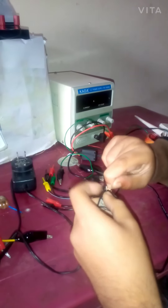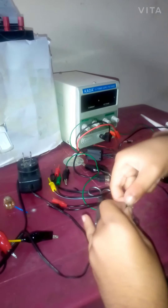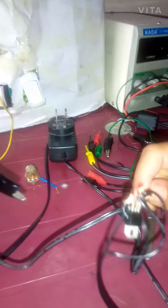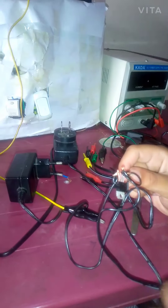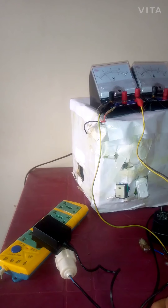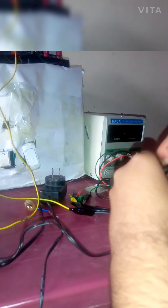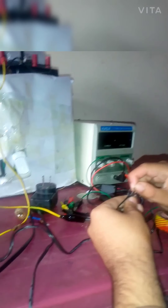The wiring is done, though it is a little bit loose. Now we can see the wiring: the positive pin of the input charger is connected to the regulator input pin, the charger negative is connected to the regulator middle pin, and the middle pin is also the output negative. The output positive is the third pin of the regulator. It does not matter - you can use any input charger above 9V to get a 9V output. You can also use 5V, 8V, or 12V versions, and even a 12V 2A charger to output 5V at 2A to charge your phone.